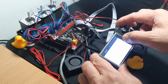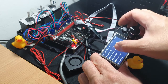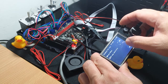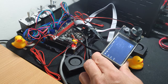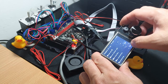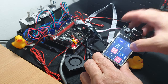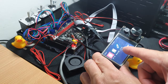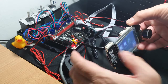Here we can even change the steps, and you can change the driver current. This will be useful when we do sensorless homing — we can change the values on the fly. We can even change the communication speed. We can read from three sources: from the USB, from the onboard SD card, and another SD card at the back of this display.